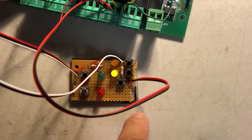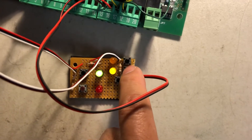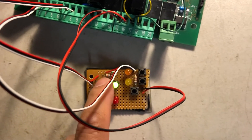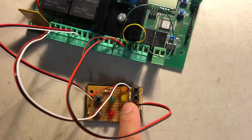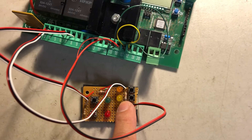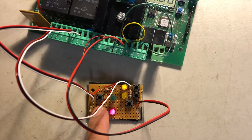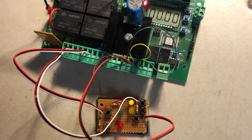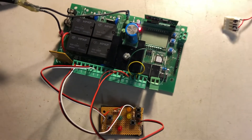I can stop the move by hitting the limit switch on the yellow and the green. Next, I can close the two motors by pressing stop again, and I can then hit the limit switch simulated by red and orange, which terminates the move — showing the board works.